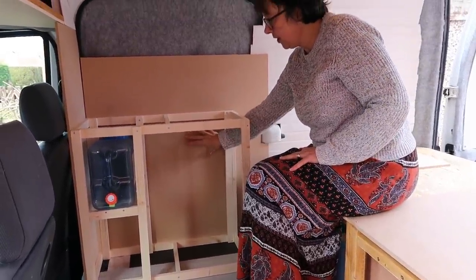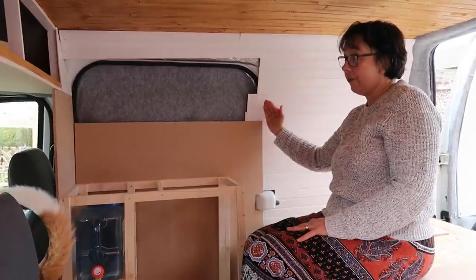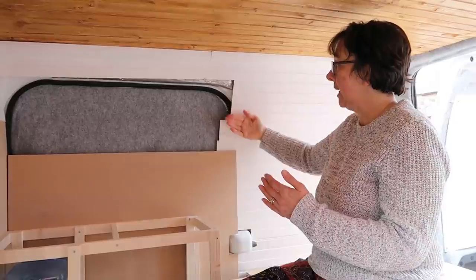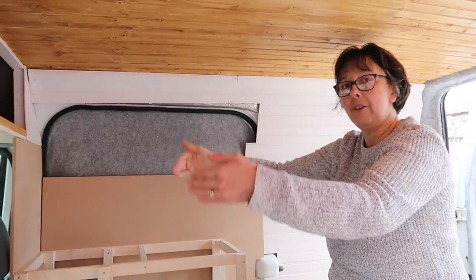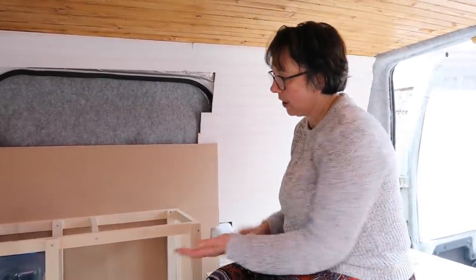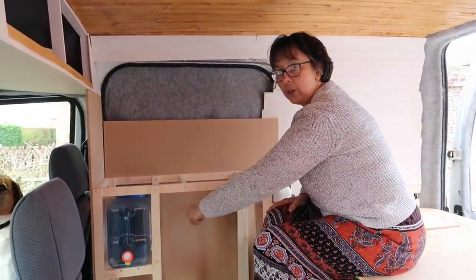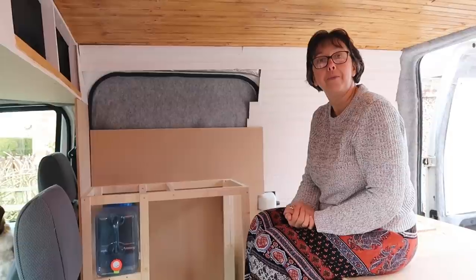The backboard is sculpted around the shape of the van and fits in underneath the big shelf above the cab. It's in two sections at the moment - one is the majority of the actual carcass which is straight, the second just starts to curve inwards. Today's tasks are to get the last section which has the biggest curve, because it's curving up to the roof as well as curving in where the cab is narrower. Then we're going to put in two shelves - one for the little cooker, one for the washing-up bowl and cleaning products, and a big space in the bottom for food and pans.